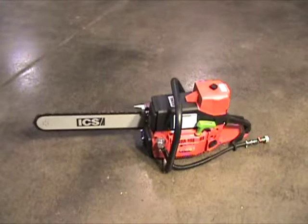It's invaluable. If you use it, say you run into rebar, and you use this to cut, this is cutting about a 3/8 inch wide groove, and your Mr. Manhole cutter extractor is going to cut about 1.5 inch groove. So you're going to have to make 2 cuts right where the rebar are and then let your cutter blow the little chunk of rebar that's left in there out of the way. So just remember, you can't make 1 cut where the rebar is and then expect that your cutter is going to go right through that.